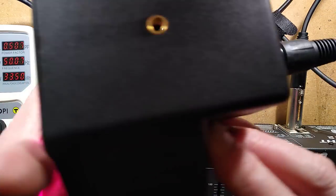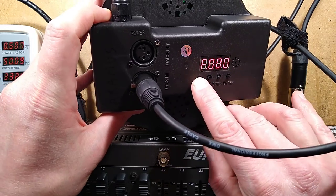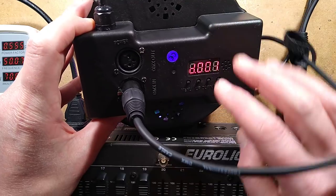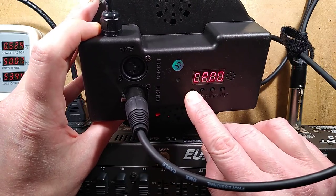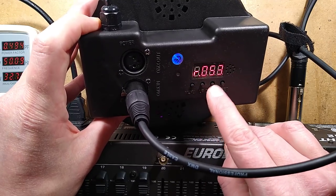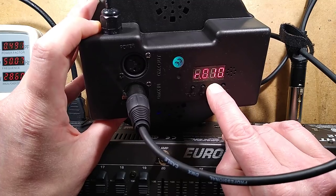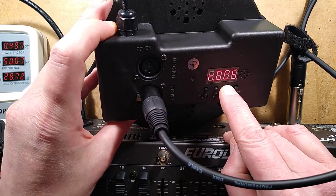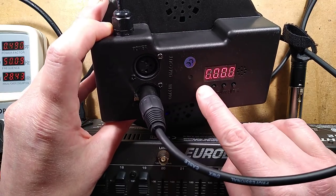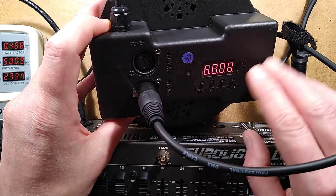Rightio. So let's take this out of the mode that it's already got. It's set to data address 1 for the DMX. Let's get the colors reset to 0. So let's go down. It's just reset to an arbitrary color value. This is the problem with these. Sometimes they really compromise on the processor. They use the low-cost processor to do lots.